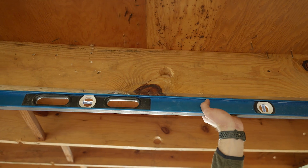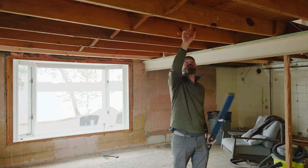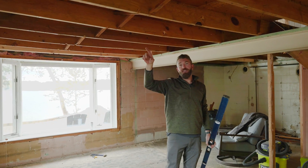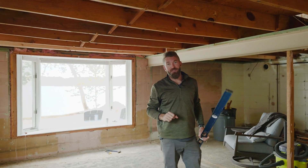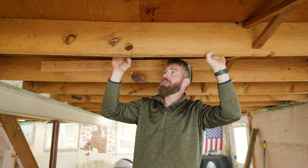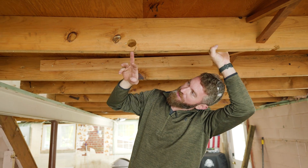As you can see we've got quite the deflection in these joists, so we need to place the jack underneath here, lift up the center of this joist, and then sister a new 2x8 joist all the way across, supporting on the foundation and the beam in the middle of the house. As you can see there are holes in the existing joist which really weakens them, especially when you've got them out here towards the edge, which resulted in a crack.